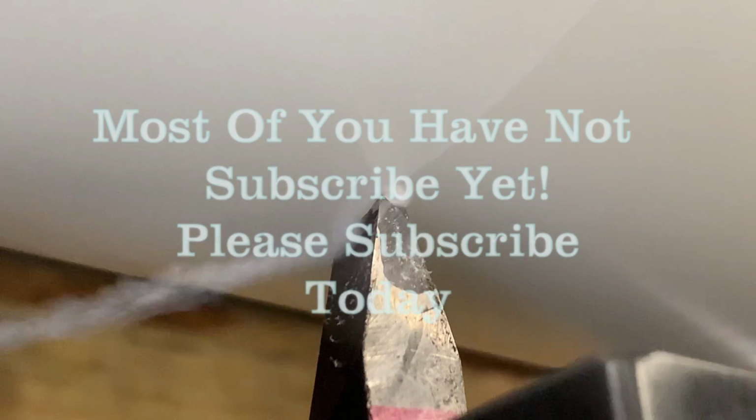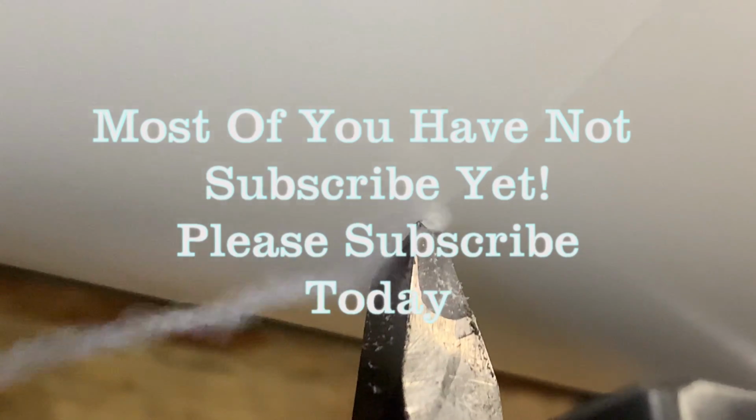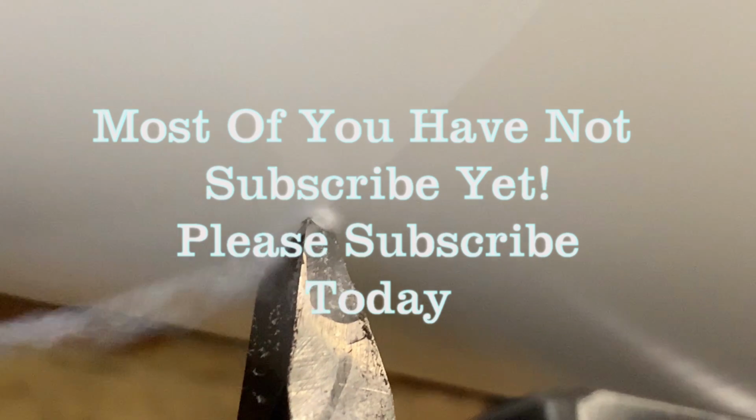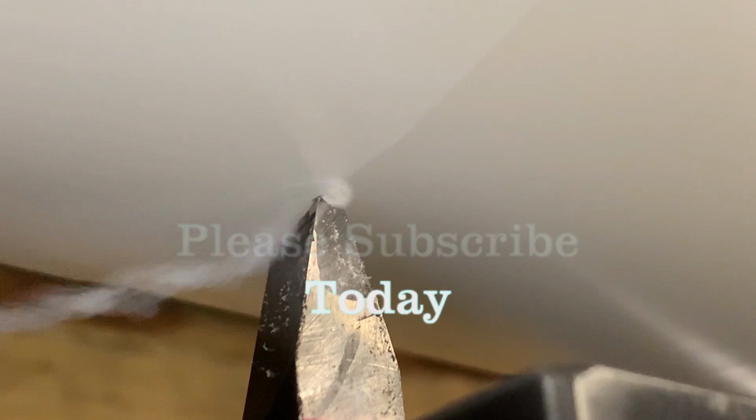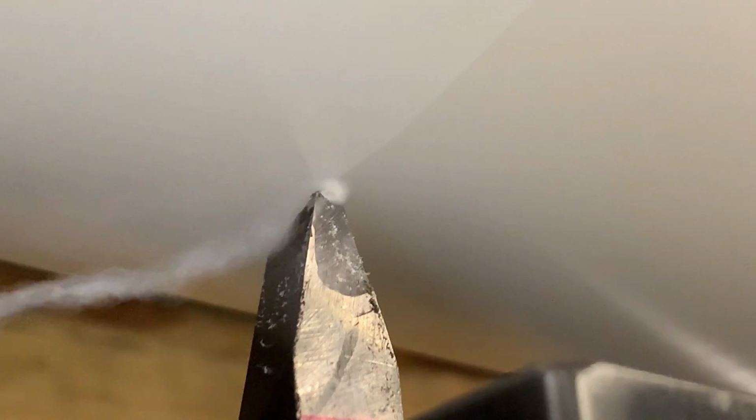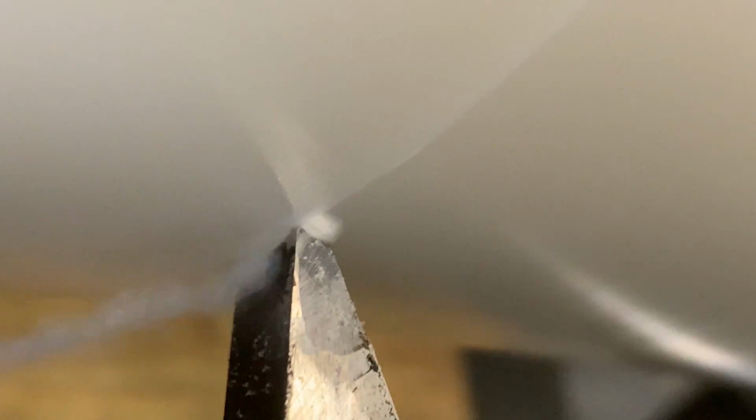When you hand grind your tools and you get a good chip, good finish, you know you've done a good job. Slight 1 degree down angle. I know you can see the grind right there. Look at the finish. Grind your tool bit. That's high-speed steel.